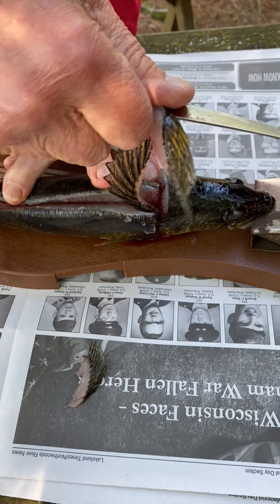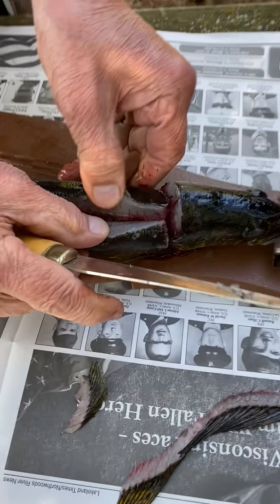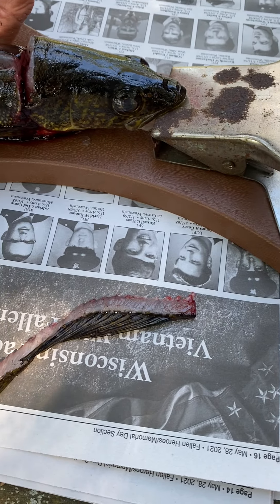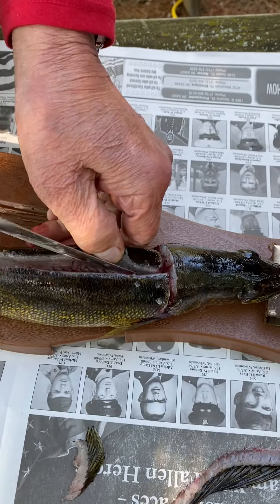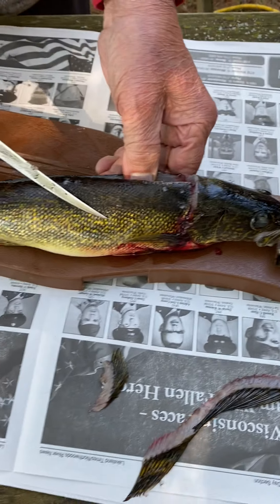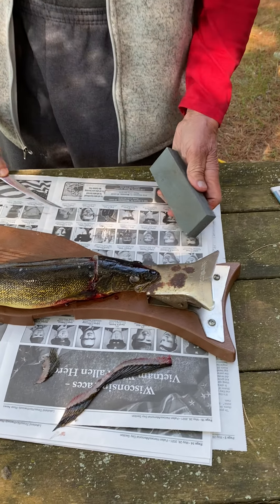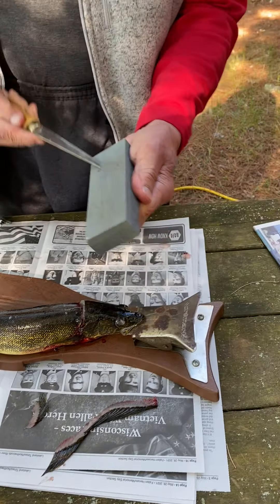I put my thumb on it and rip. Okay, that's what it looks like. Now you look in here — put whatever you got in your hand and run your thumb along there, just so you get to feel what I'm looking for. That's the top of the spine, and you want it cut on both sides. So we're going to take this. This side is always the easiest to do for a right-hander, because it lays over and then you're working this way. But again, this is still not sharp enough. Brand new is not sharp at all — it's got a factory edge on it.